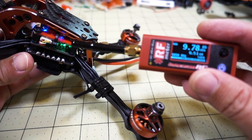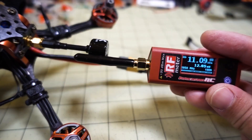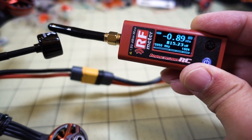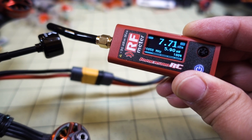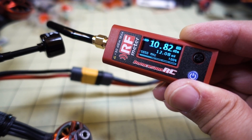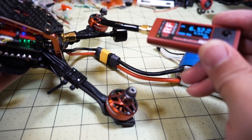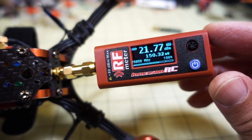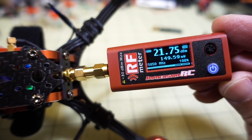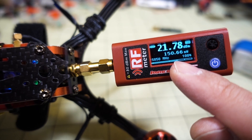I'm bringing in another drone also supposed to be transmitting at 200 milliwatts — it's an off-brand, a Hobby Mate Comet drone with a lollipop antenna, which is linear. This highlights a limitation: when you're using a linear antenna versus a circular polarized antenna, the meter showed only 6 milliwatts, which can't be correct. So I connected the meter directly to the SMA connector without any antenna in the way, and now we're reading 150 milliwatts — it's supposed to be about 200 milliwatts, so this one does seem to be lower than it should be.